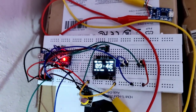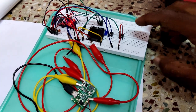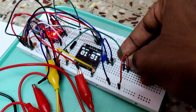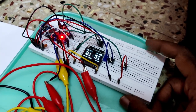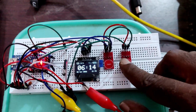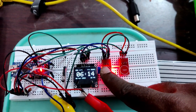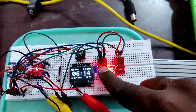Then I created the Arduino sketch and tested it with a breadboard circuit. The link to the source code is available in the description. At first I started with tactile button switches, but later, considering the waterproof design, I replaced those with touch sensors — one for navigation through date/time settings, and another to adjust date/time, turn on the display from standby, and adjust the display brightness.